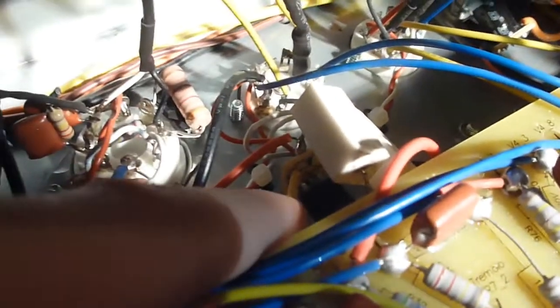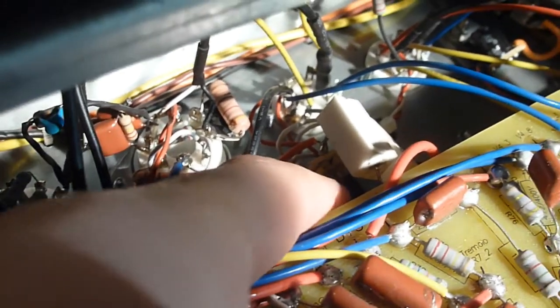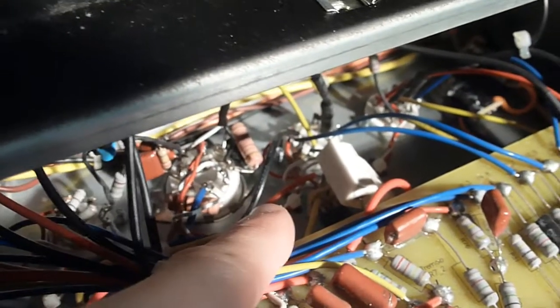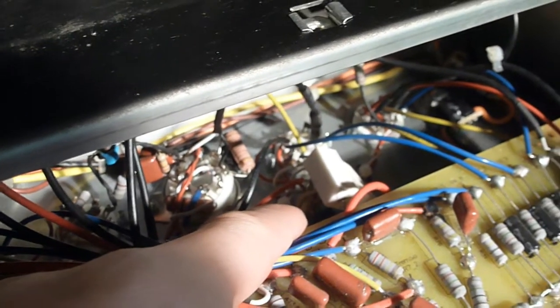Maybe it got too hot or something and melted an insulator up here on top, or maybe it just punched through the mica insulator. My guess is that there's an electrical insulator that will also transfer heat, because you can't just take this off the board entirely or it'll overheat, because there's a lot of heat that gets dropped through there. I think there's quite a few.